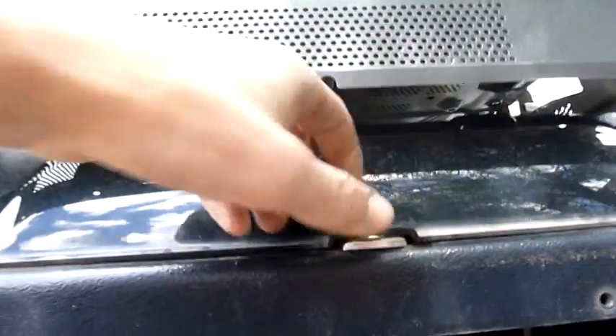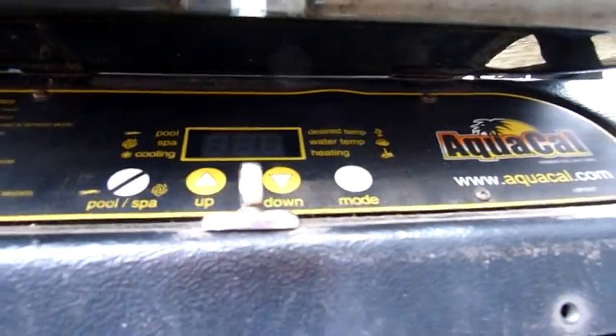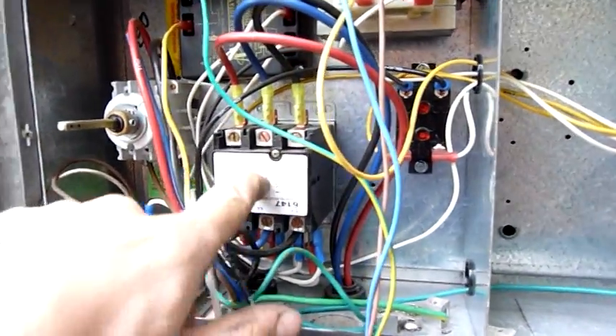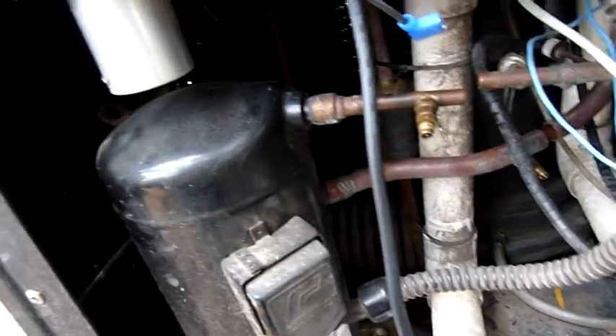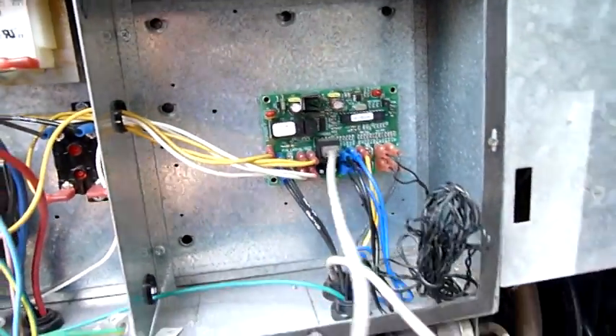There's a phase rotation monitor. I have had power up to the control on this, but the control readout doesn't really do anything — you just get fault codes because there's no water pressure, no refrigerant pressure, all kinds of things wrong. But it does work, it powers up. I just don't have three phase to run it properly. I can use the VFD, but as soon as this thing builds head pressure, the VFD will go out on overcurrent. So this thing's going to get pulled to bits.